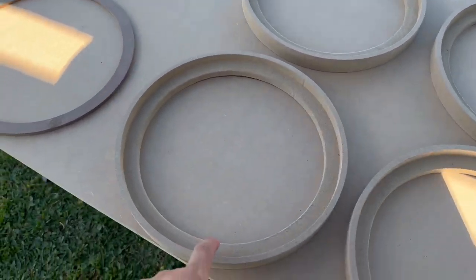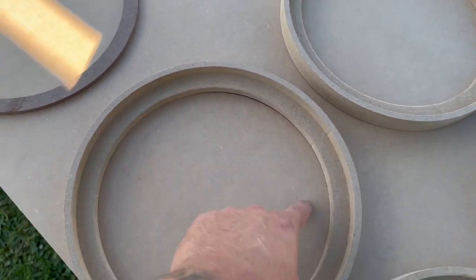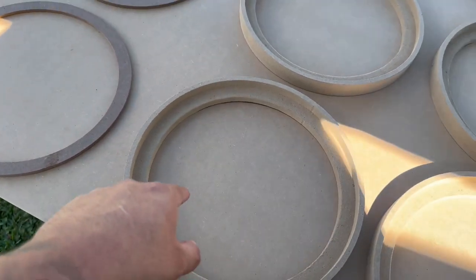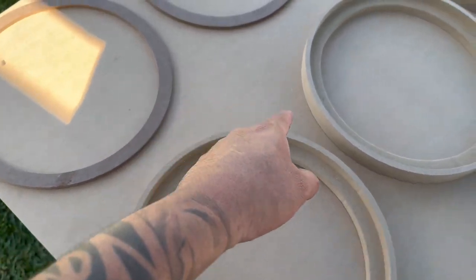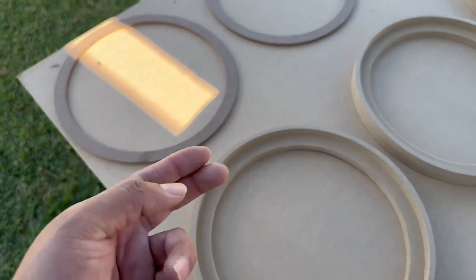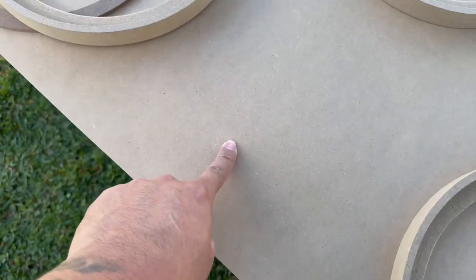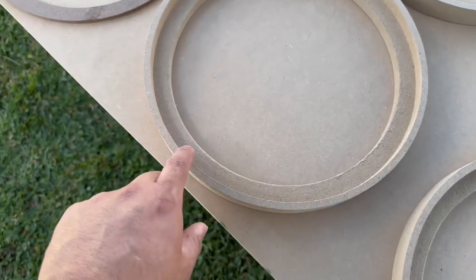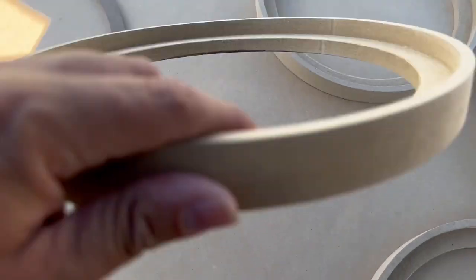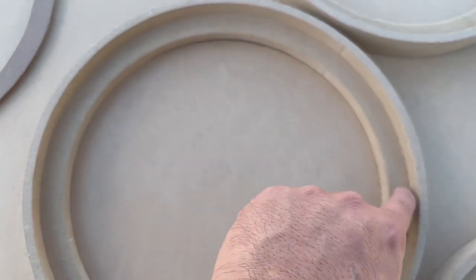So what I'm going to do is staple the rings down in this lip. I am gonna cut a good chunk of this inner out. Then I'm gonna come through and router it out so the speaker hole cutout is there. Then I'm gonna come back and router the outer edge. And then the baffle, I guess you wanna call it, where the speaker is gonna sit, is gonna be this 1/2 inch piece of wood. So then I am gonna come back here and cut a lot of this 1/2 inch extra on this ring off. Then I'm gonna come back and set my router and flush cut it all the way up to the edge. You follow me?